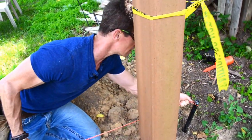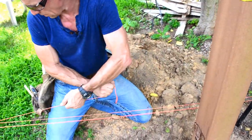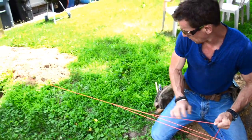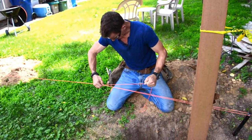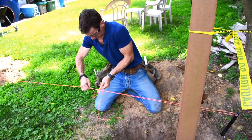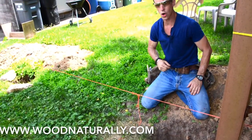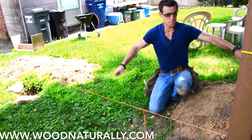You can see how tight it is already. Another reason for the steel pipe is those threads — I use them to trap the line in here. So I'm pulling this, all the stretch is coming out of that, and I'll just lash it off with a half hitch. It's a little easier with rope, but there you go. No sag, all accuracy. Let's build a fence.